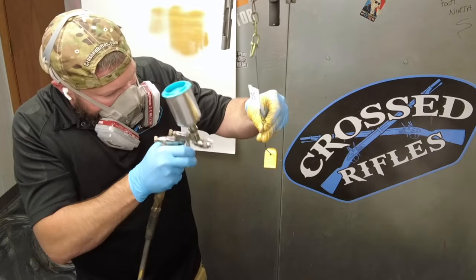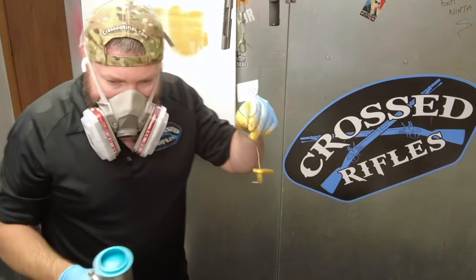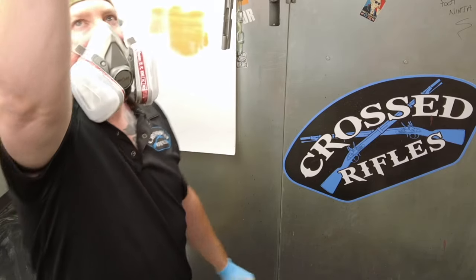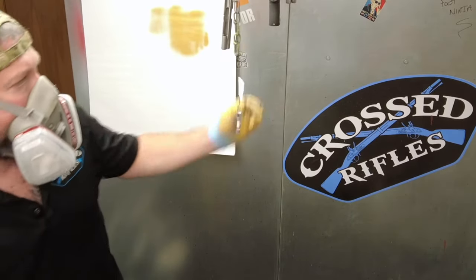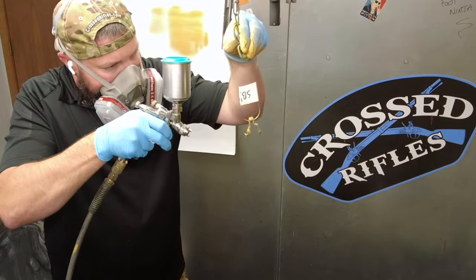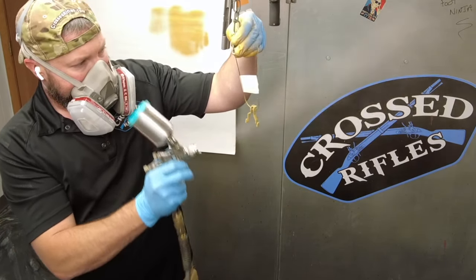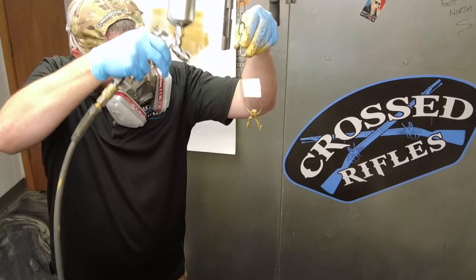For small parts, there's no octagon — no 12-sided octagons. You're just going to spray from a bunch of different directions and make sure you're laying a good coat without mushrooming anything, and make sure you get enough material. We take it outside the booth, let it air cure, and then take one last look. You've seen videos where we jump back in and hit a piece again if there was a light spray somewhere. Two sets of eyes is always going to be better than one — sometimes you see things in different light. It's always good to have somebody spraying with you, but it's not always possible.